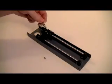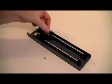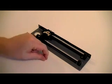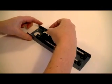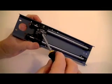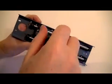Take the Y-axis belt holder and, with the two prongs pointing downwards, position its fixing hole over the centre brass threaded socket in the Y-axis linear bearing block. Fix the belt holder with one bolt.